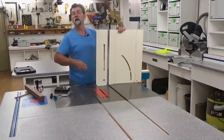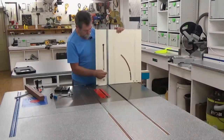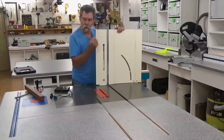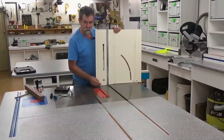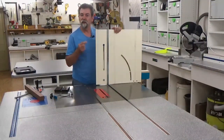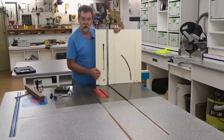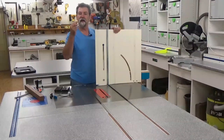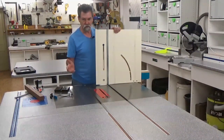How did I get around it? Took me 2 minutes. I took every second grub screw out, took the spring out of those, took the ball bearing out of them. I kept the springs. Then I undid the grub screws from the alternating holes and put that second spring, that I took out of the other ones, in over the top of the other spring that was already in there. Put the grub screw back. That increased the length of the spring and it works beautifully.